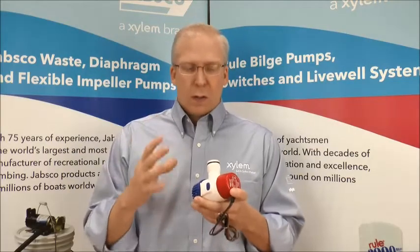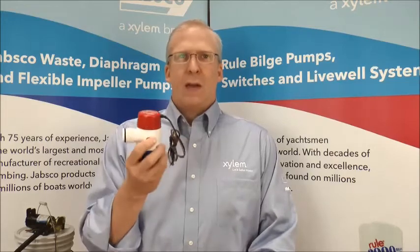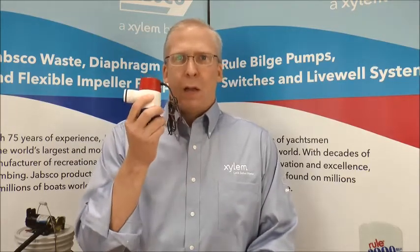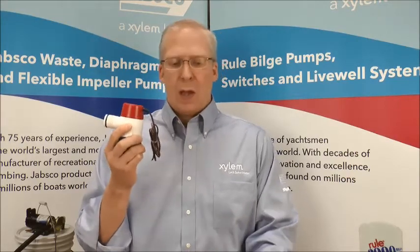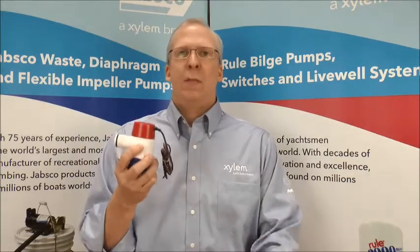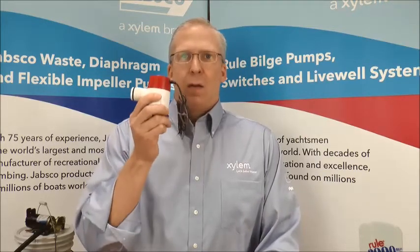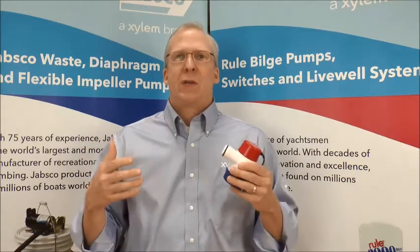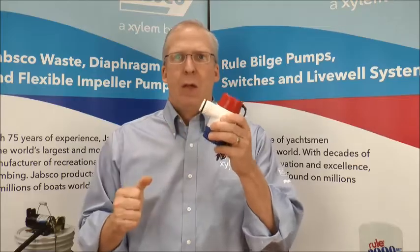We took a hard, close look at the hydraulics and we were able to make the 1100 gallons per hour pump operate at 1100 gallons per hour at 12 volts with the same amp draw as today's pump. What that means for the 360, the 500, the 800, and the 1100 is these pumps are running at 12 volts pumping the capacity shown on the top of the pump. That's big. So when the customer's boat is at a mooring, they're going to get 1100 gallons per hour out of the discharge of this pump at 12 volts.